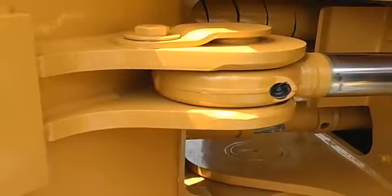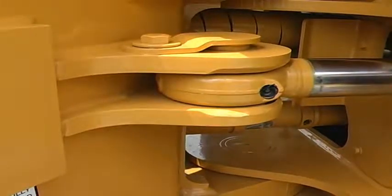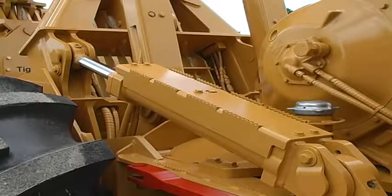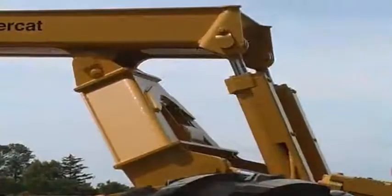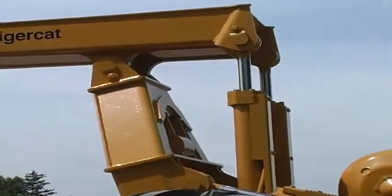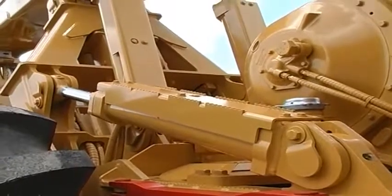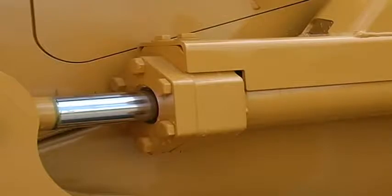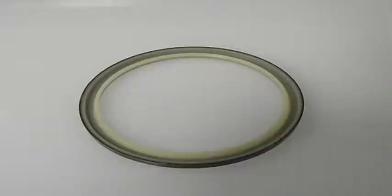The steer cylinders are oversized with large pins and pin mounts. The cylinders are designed specifically by TigerCat for forestry applications — they are not off-the-shelf items used on construction or agricultural machines. Compared to those found on competing machines, TigerCat cylinders have a larger bore wall thickness and larger diameter rods. The rod eyes are forged and the cylinders are equipped with long life seals.